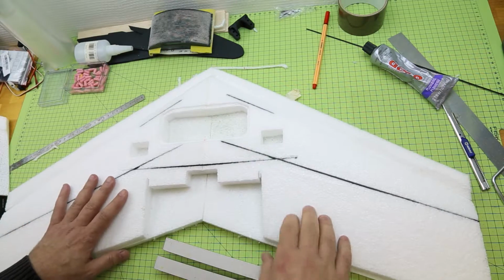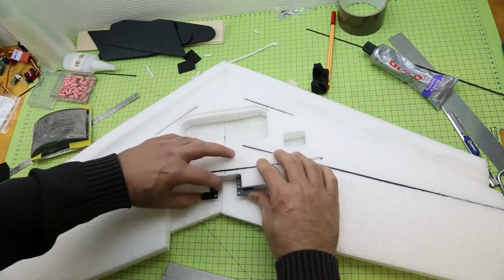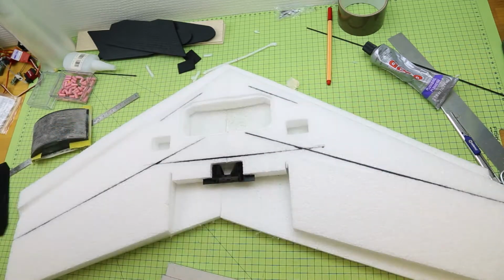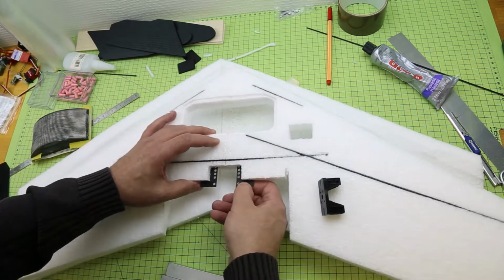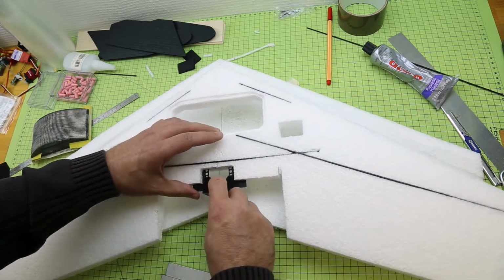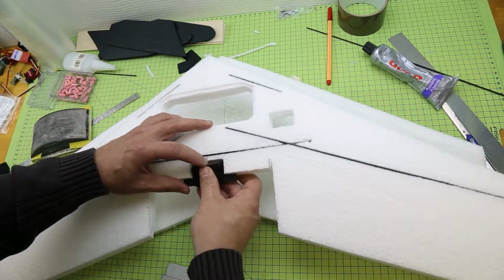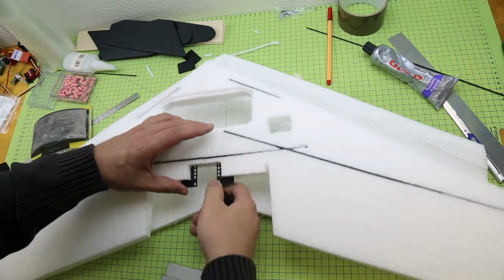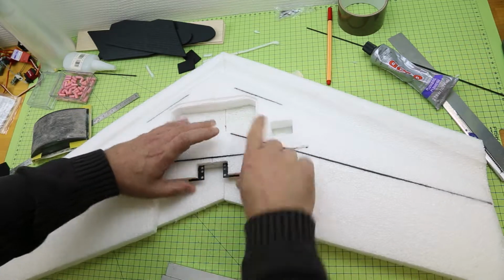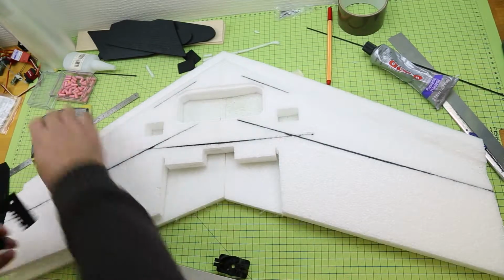I think I'll do that on this core upside down. Okay, I tried looking online because there's 2 lines here. I wonder if they're supposed to line up with the trailing edge there. But if it's sticking out like that anyways, it'll be flimsy. Yeah, I think it needs to go in. I'll just use a lighter battery if it's too nose heavy. Okay, I'll get ready to goop that. I think I'll prep it a bit by sanding it.